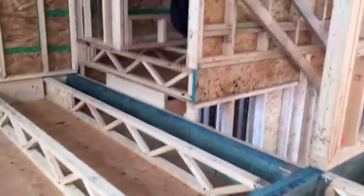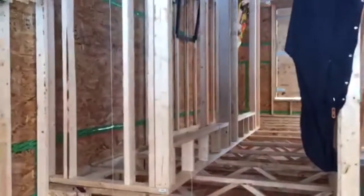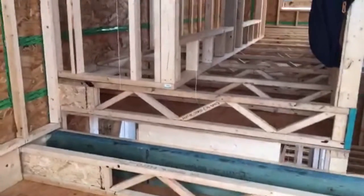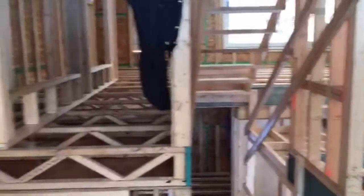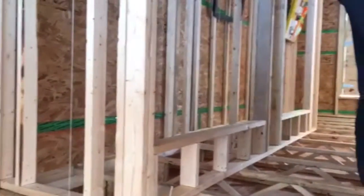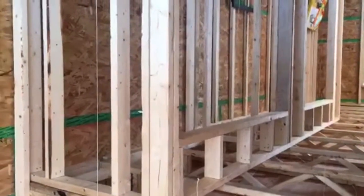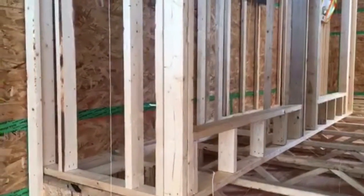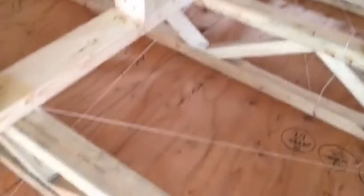In this house we intentionally stacked all of our services on the north wall on top of each other, so our duct runs and plumbing runs can come straight down into the mechanical room without having to cross the house and get through those beams. You can see we've got a series of interior walls here for the laundry room and powder room — these walls are going to be chock full of plumbing runs, ventilation runs, and electrical runs. They're really our service core of the house.